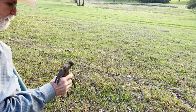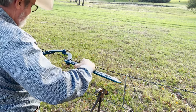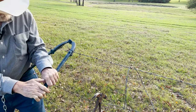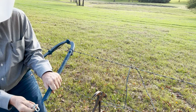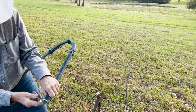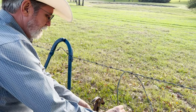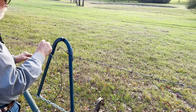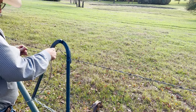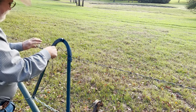I'm just going to put my length of wire here on that top wire, and my pliers where they're easy to access. What you do is spread this articulating arm apart like so, grab the wire, and then you've got to use your body — you're going to come and get that as snug as you can, and then catch it with the chain. There you have it — it's caught the wire. You can see the little bit of a bend that gets it plenty snug. Then you're going to take your length of wire — probably best to wear gloves, but I don't typically carry gloves.